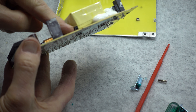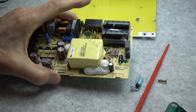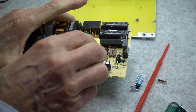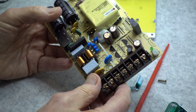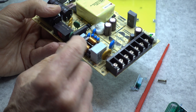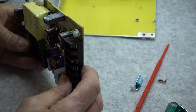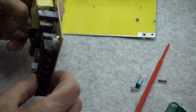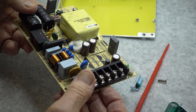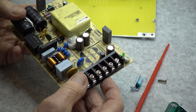Although the transformer is mounted by pins which are soldered to the board, because the transformer is fairly heavy, if the power supply gets accidentally dropped they don't want the transformer to tear loose from it. So it looks like a good little power supply — reasonably well made, lots of filtering, good high quality components. The electrolytic capacitors are rated for 105 degrees centigrade, which is good — that should be much higher than the temperature the power supply will ever be exposed to.